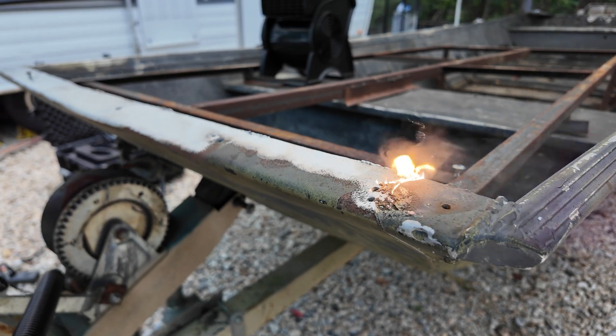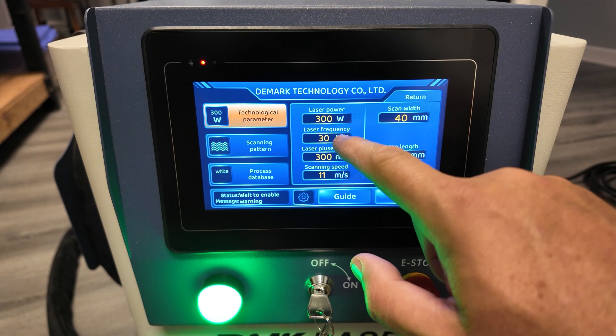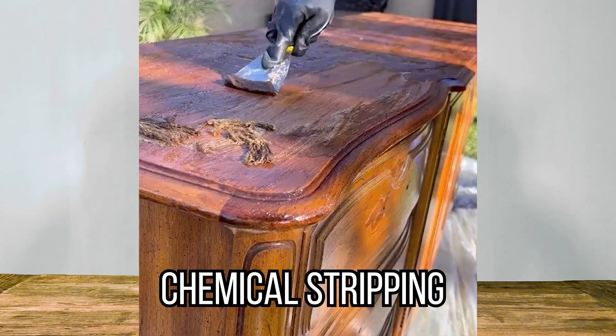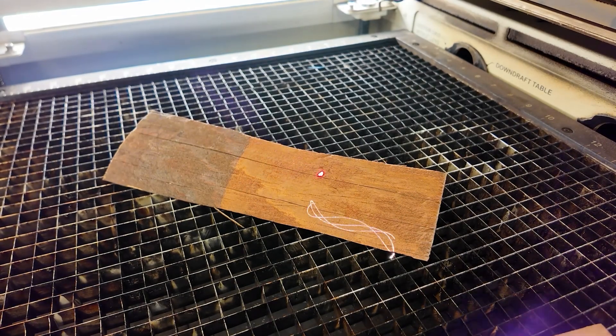First, a quick recap of what laser cleaning is. Laser cleaning machines like the GT500 use high pulses of light energy to remove or ablate the surface or contaminants of various substrates in a very controlled way. It does this by controlling the power, the frequency, the pulse width, and the shape of the beam. So it can be very hard or very gentle. This method is preferred over chemical stripping, sandblasting, or water blasting because you can tune it to remove very thin layers at a time without harming the substrate underneath.